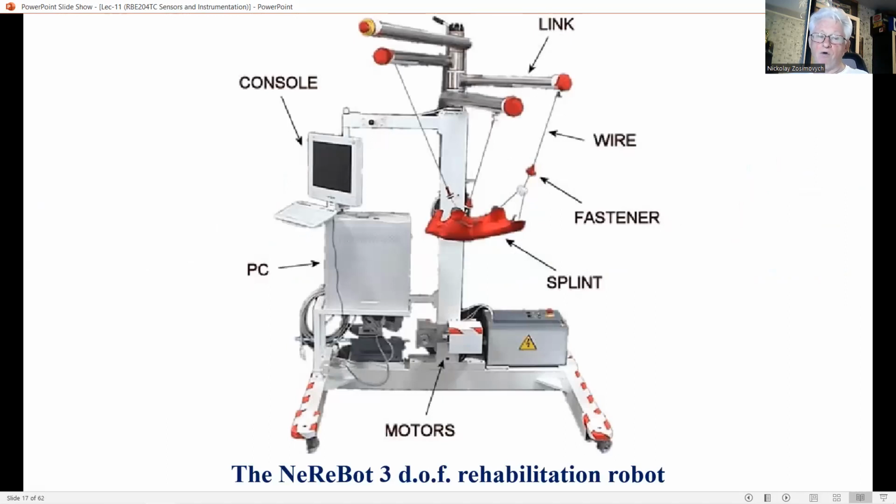Tracking systems are also used in rehabilitation to study the movement of people. Here, the reflection mode is common practice to minimize movement restrictions for the test person. A set of reflecting pads or spheres is positioned on specific locations on the body, like arms, legs, head, shoulders, and feet. These markers are illuminated by a specific light source, for instance infrared, while the reflected light is viewed by a set of cameras.